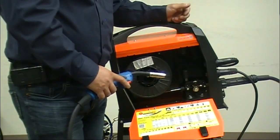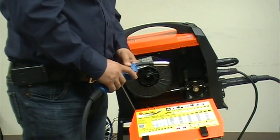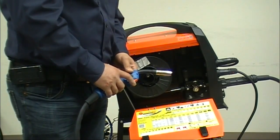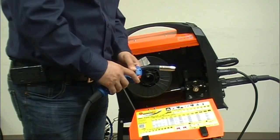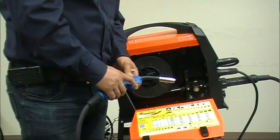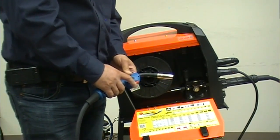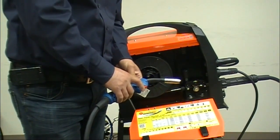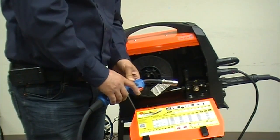I'm going to talk about the safety feature on the HP 2000. When you feed the wire through, it takes a little bit of time, so when you push the trigger at the beginning you need to keep pushing it until the wire comes through the gun. It keeps feeding and then it will stop when it recognizes there is no welding going on — the machine shuts off. You need to re-push the trigger until the wire comes through the gun.